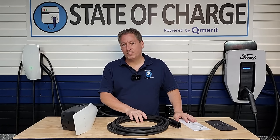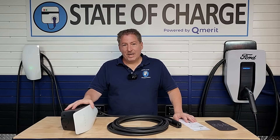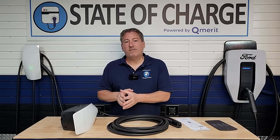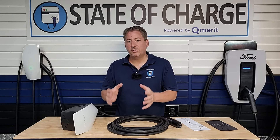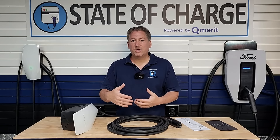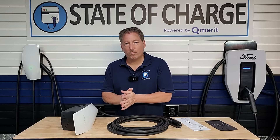This can deliver up to 48 amps, just like the Tesla Wall Connector, and you can derate the power inside if you don't have a 48-amp supply. If you want it to deliver 48 amps, you need to be on a 60-amp circuit, because you can only deliver 80% of the circuit's maximum load — 80% of 60 amps is 48 amps.